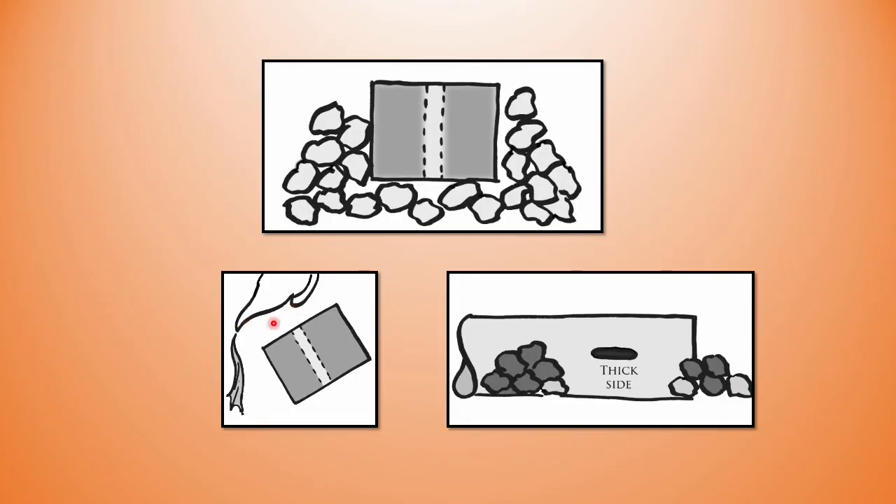If it goes wrong and you've got a thick and a thin side, there are a couple of things you can do. With mild steel, you can quench the thinner side — the tool moves to the path of least resistance, so the hotter side will move out and re-center the hole. With a hardenable material that can't be quenched, put the thick side down in the fire covered with coals and the thin side up and uncovered — looking for a difference in heat so the thick side comes out hotter. If everything went well, orient the hole north-south in the fire; we don't care about a gradient from bottom to top, only from side to side.